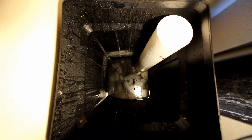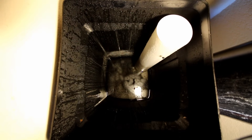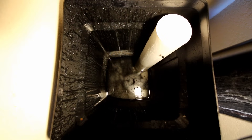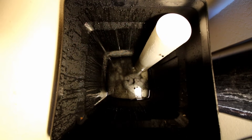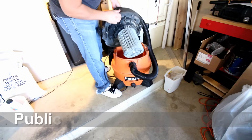Here's a look inside the brine well. Normally when you look in there the bottom is full of white salt, but down here you can see it looks kind of mucky and dark — that sediment is actually dark gray, almost blackish in color. I've been stirring it and running a cycle for a couple of nights to eliminate as much salt as I can. I'm going to go ahead and hit it with the wet vac, take the water out, and show you what the sediment looks like.